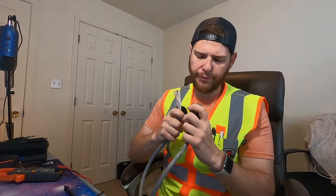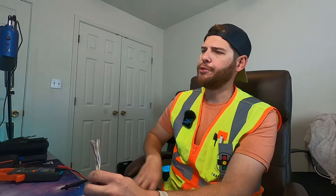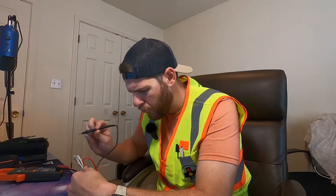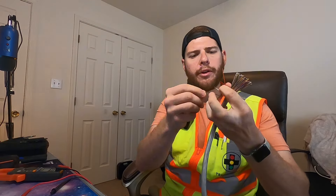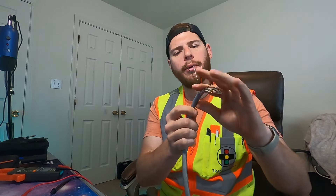Now we're going to look for the AC line. On this diagram it shows it is a lowercase 'P', so on this connector you're going to look for the lowercase P. Let's go ahead and stick one lead into P - and there we go, we just found P, which is this orange cable. That's going to be our AC line. We've got our neutral which is the green one, and our ground which is white and black. These are the three cables we need.